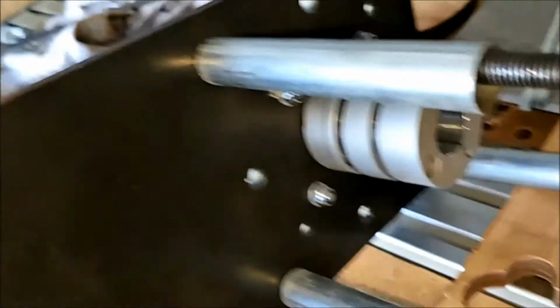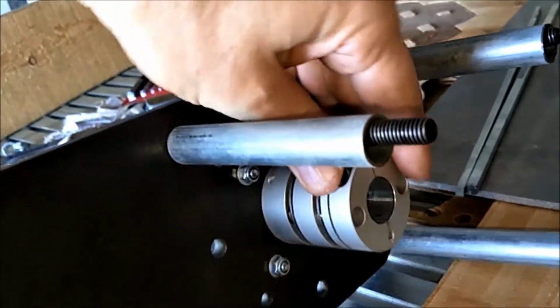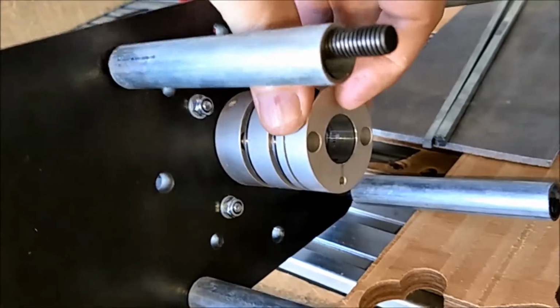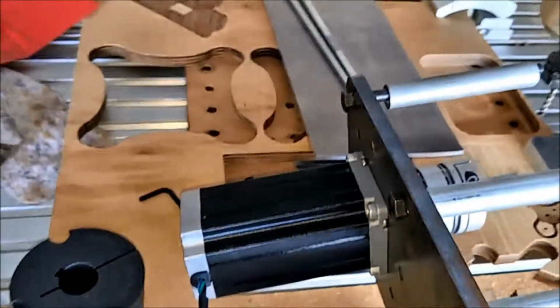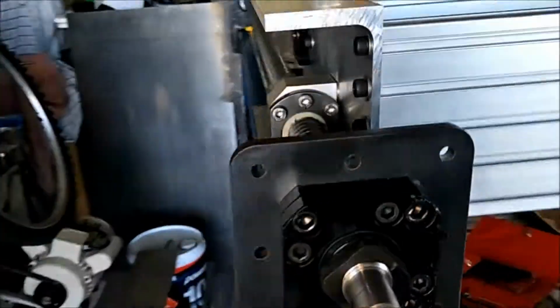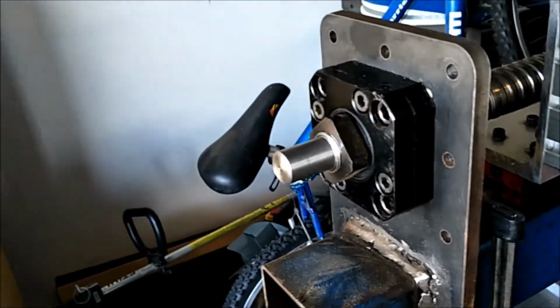Okay, so the motor's off. You can see originally all that holds that guy on there is just this little Allen key screw here. So it's merely just grabbing the shaft via a clamping force. There's no key involved there, and that motor is turning that shaft quite nicely without any hassles. So there's no reason why I'd even need the keyway in here.